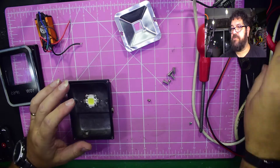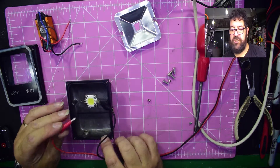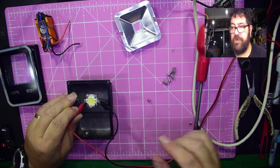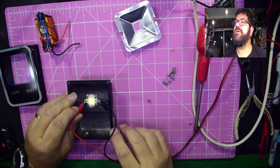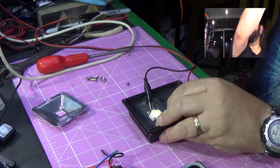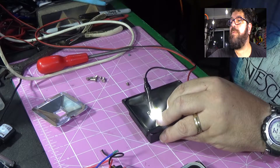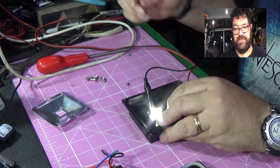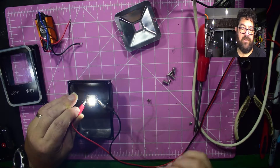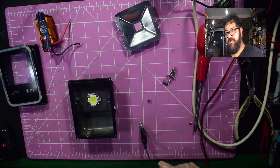To test, let's make sure we're on low power - about seven volts on there at the moment. On seven volts we are actually getting all nine segments lit. If I bring it up a little bit more you should see more segments lit. Let me turn down the light above the bench so the camera can pick it up. At nine volts - any more than that without regulating the supply down is probably a bit too much. The LED needed changing and that's what we've done.